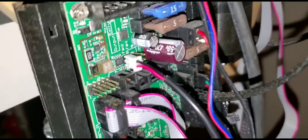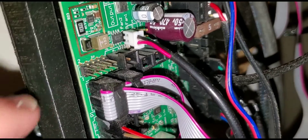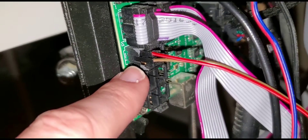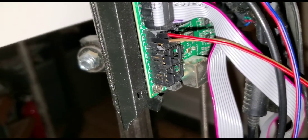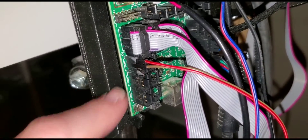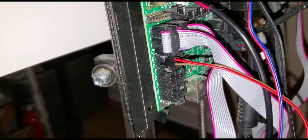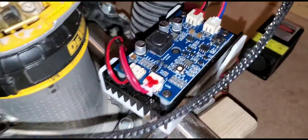What I've done is I've run the power out of fan 2. I pulled the shrouds off of these. These two pins are for the TTL and they've been remapped to a TTL output, so it's reading from 0 to 5 volts instead of 0 to 12 — this one has the TTL, not the PWM.